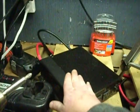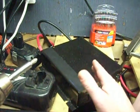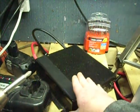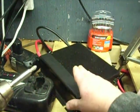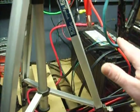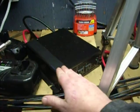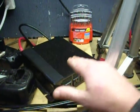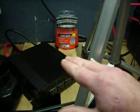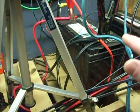Let's go over this again. 1500 watts at 120 volts is around about 15 amps. So 1500 watts at 110 volts, the draw off of my 12 volt battery bank is around about 150 amps running this at full bore. To make the same amount of power off of a 24 volt battery bank is instead of a 150 amp draw, you're talking about 75 amp draw.